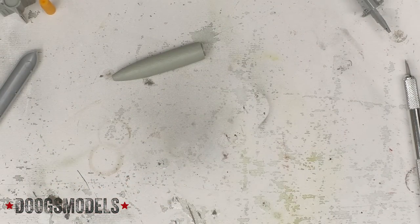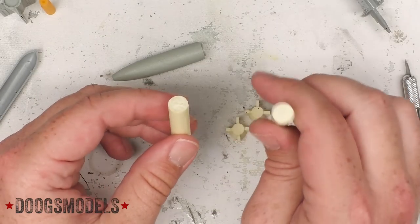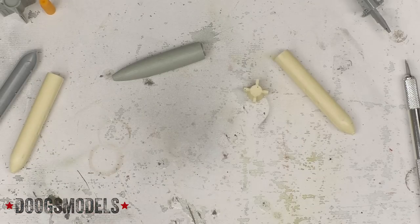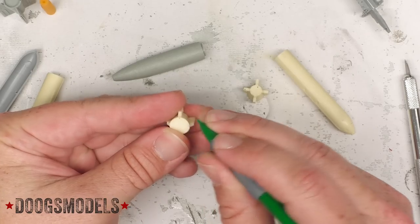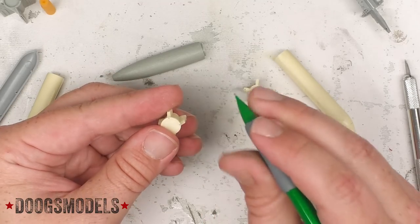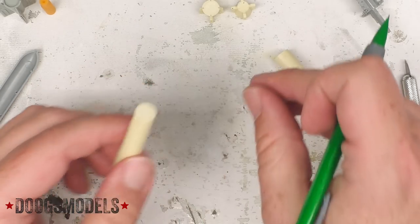Now, before I go ahead and drill all of these various holes, I want to make sure that I've got the holes prepared for mounting up the Rockeyes. And so I've marked the locations of basically the fins on this one. I need to do it on this one too. The idea here is we mark the 90, 180, etc. Then we draw lines, and that helps us find the center. Okay, so just like that. And I'm going to do the same thing on these.